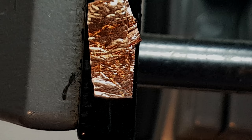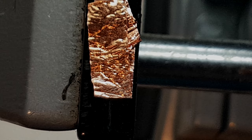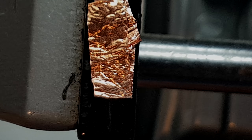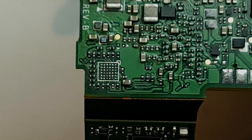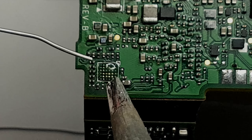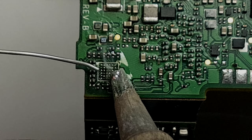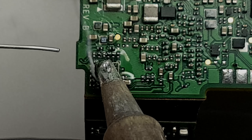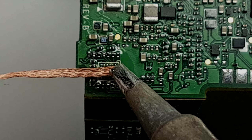So the balls look okay — I know it's funny. Next I will clean the part on all sides if possible, just to remove any remains. It's time to prepare the motherboard. Next I will apply some flux there. I will take my soldering iron and hopefully I can remove all the bad lead-free solder from here, and now I will go in with my solder wick to remove everything from there.